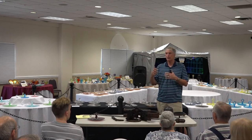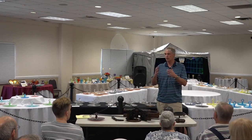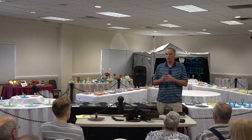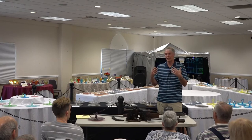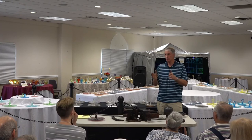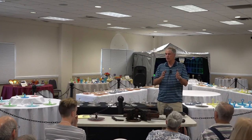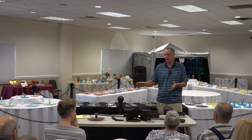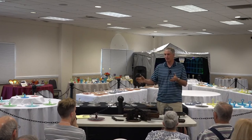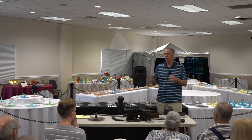You can make a ruby batch that strikes very dark and strikes very easily. We would do that on very small pieces, cup plates, to get a red glass that comes out of the furnace that way. But if you bring it out with that easy striking on something that you finish, it's going to turn black or brown on the edges. So I think we had like 7 different ruby batches with different amounts of colorants in order to get a range of things that were fairly consistent. If you put the pieces of glass on the table, they would look the same, but they may have come out of 4 or 5 different batches because of their shapes.